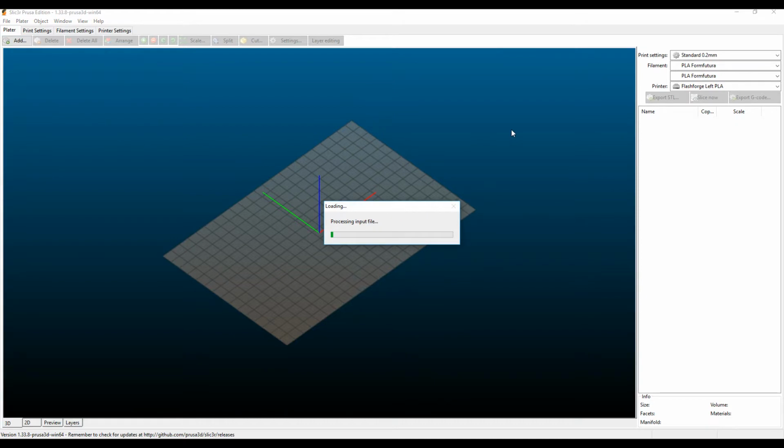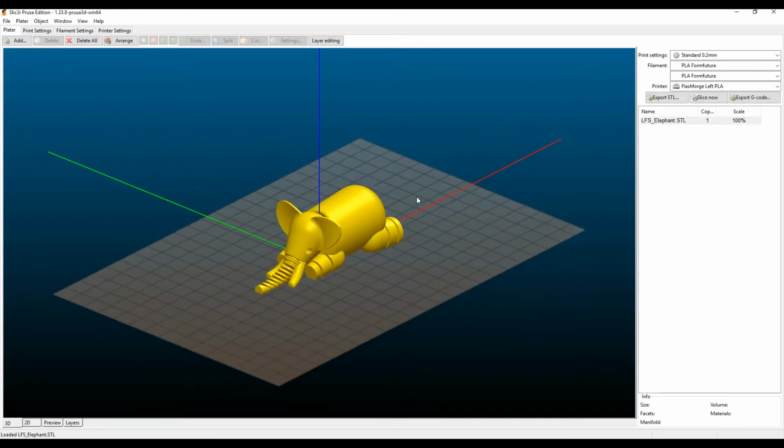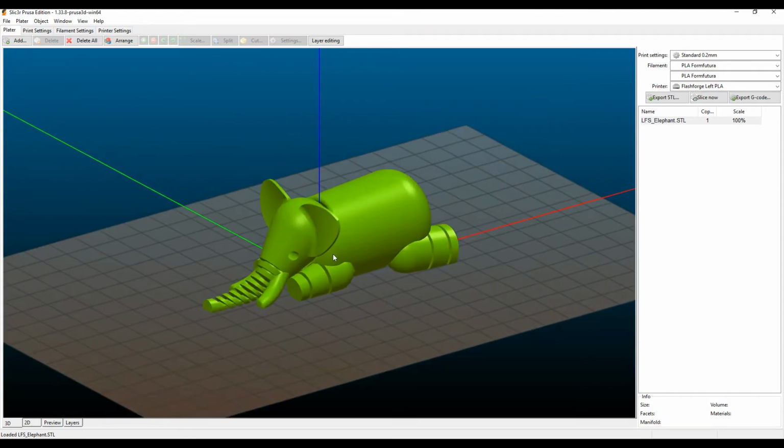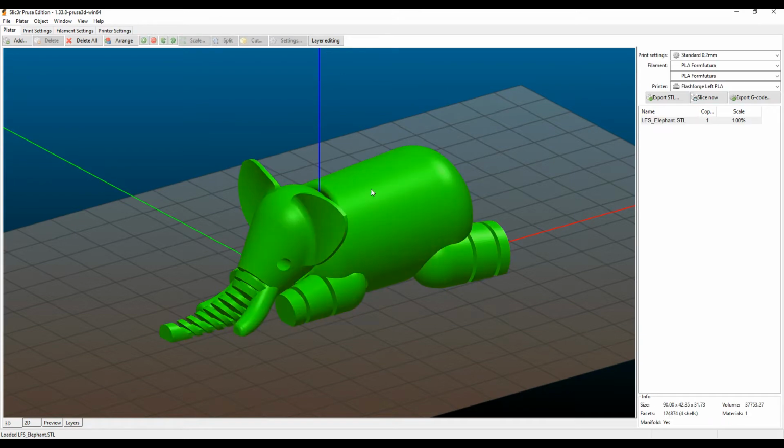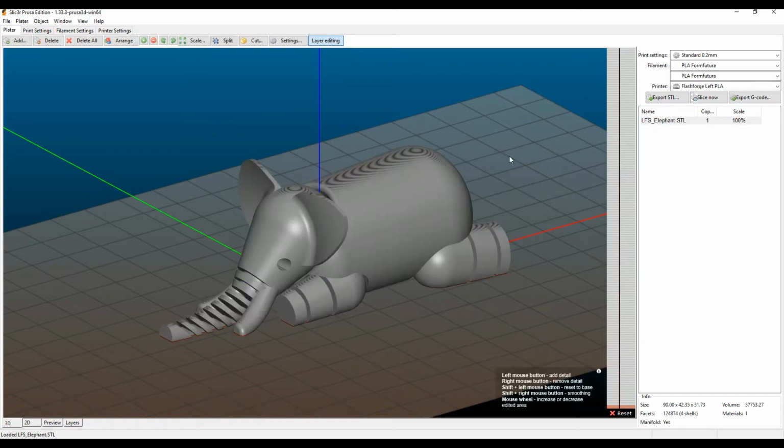Import and arrange parts on the build area as you would normally in your regular Slic3r software. Let's start with a model of an elephant. This is a popular model on Thingiverse by Lefabshop, link in the description below. The base layer height for this model is set to 200 microns. For the variable layer height function, you can click the new layer editing button in the toolbar. With this function enabled, you can select areas on your model where you would like to have a smaller layer height to create a smooth surface.